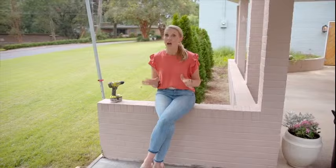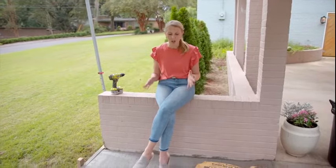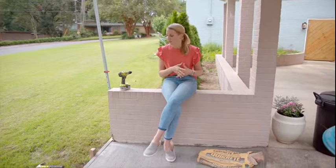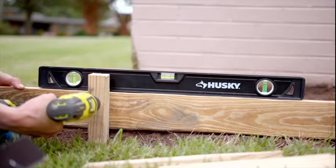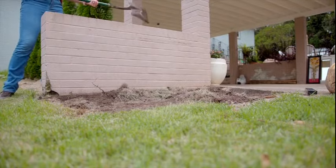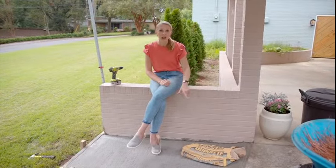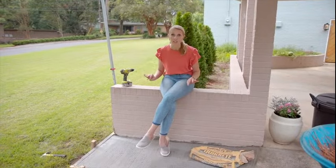I'm going to walk you through the process of how I did it and show you how easy and quickly it can be done. The first step is to mark out and figure out where you want your area to be. I made ours 32 inches off of this existing wall, and since we have two garbage cans — one for yard stuff and one for house stuff — I made it as wide as this wall as well. You'll also want to consider how tall or shallow you want your garbage can pad to be. We had the driveway nearby so I wanted it to be level with that, but if yours is standalone you might want it recessed into the ground so it's level with your grass to make it easier to mow around.